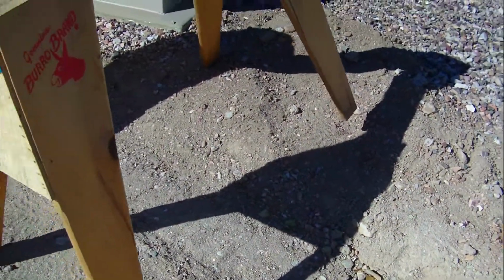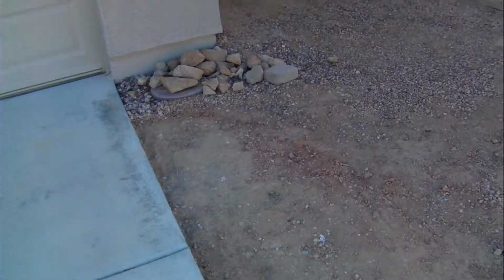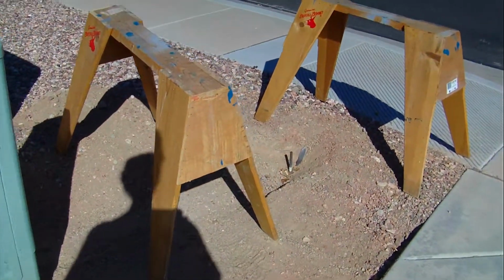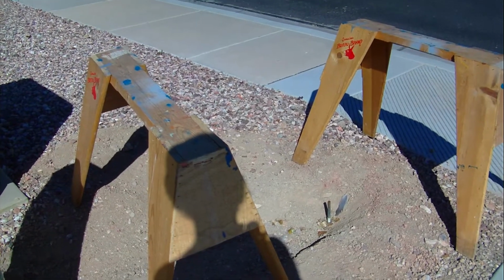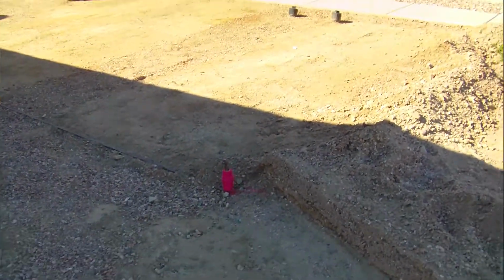So this trench right here that you're looking at followed a string line. Now I have it roughed out now. This is a rough draft. As I get this triangle flattened out and sloped correctly, I'm going to re-stretch the string. I may add a little bit of elevation out here at the street to where the water stays up and ends at the surface of the sidewalk. But that's my solution for what the builder did to me 10 years ago.